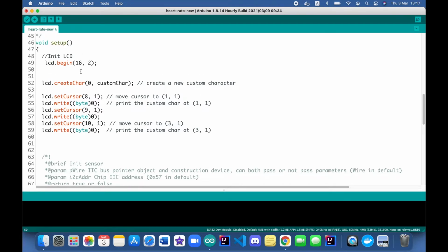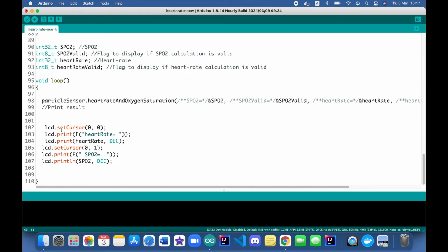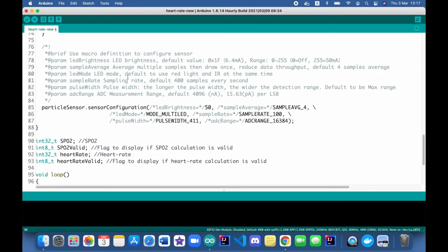begin the serial with 9600 or larger, maybe larger is better. And then instead of all of these LCD lines, I mean, with the heart it doesn't work because you need to print something. It's easier on the serial monitor, so you just print a heart shape. Take it from the internet somewhere, and just print. Then you can skip these parts on serial. But here where it says print heart rate, just replace these lines with serial, then you will have them on the serial monitor.